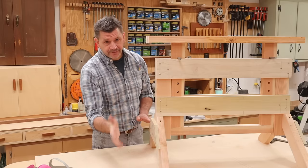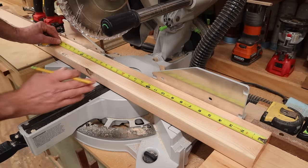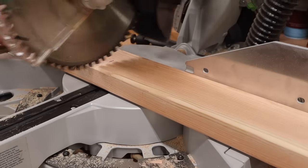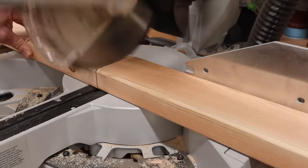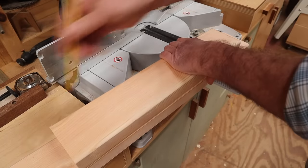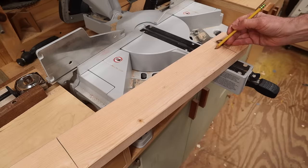I'm going to get started with this part, which I'm referring to as the feet. I'll start by rough cutting pieces of 2x4 a little heavier than 17 inches — I think 17 and a half works good. With this first board cut, I can use it to measure the next three. I'm going to try to avoid knots, especially because they would be at the end of the foot.